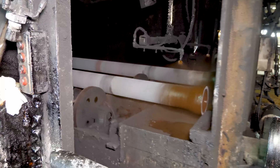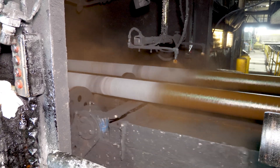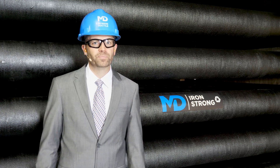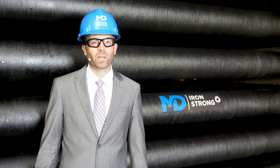Silcoat is the black paint that lines and coats our pipe. It is water-based and contains no harmful chemicals. It is NSF-61 approved for use in culinary water applications. As you can see, the Silcoat is a dark brown color when it is applied, but dries to a nice, even black.